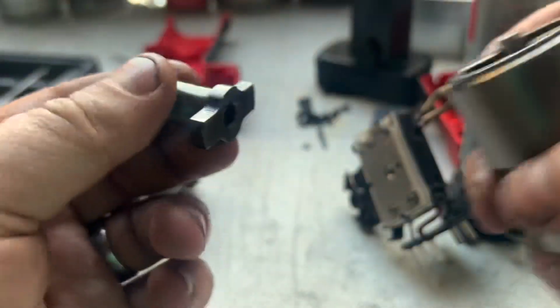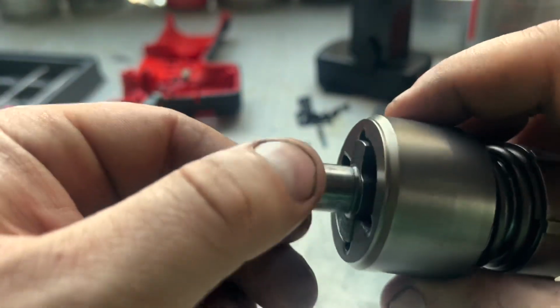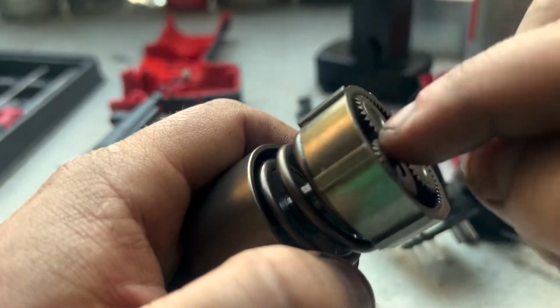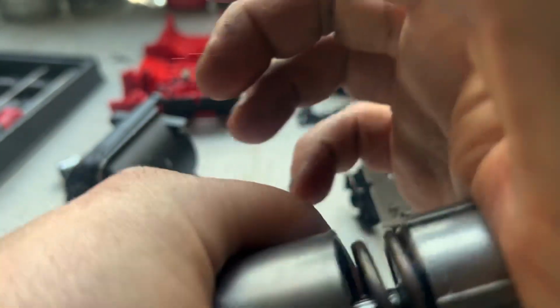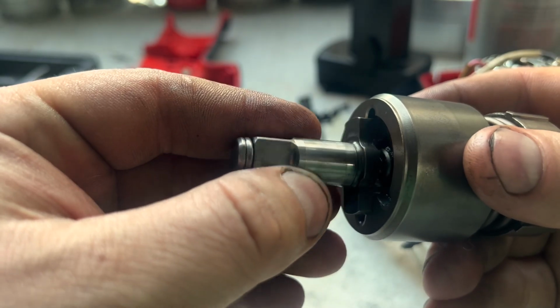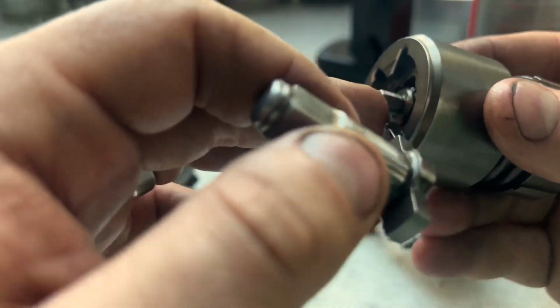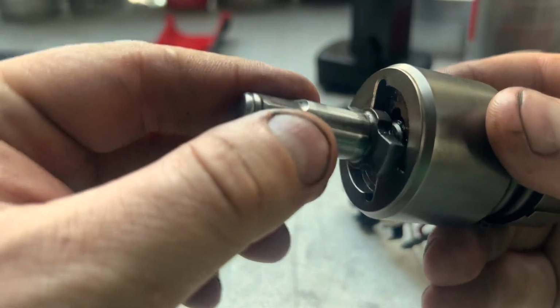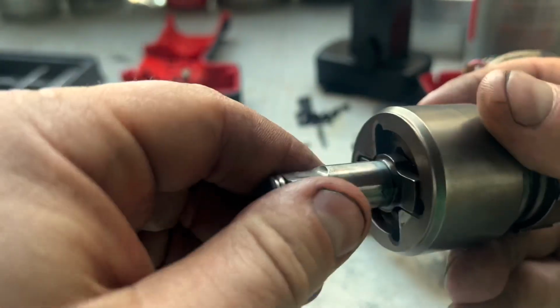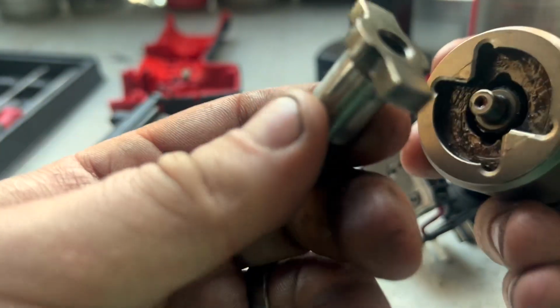There we go. So what happens is, as this is stopped, the torque from the gun will turn this and in turn close that spring. And then it's the force of that spring once it overcomes up here. Once the travel of this piston has gotten high enough that this can clear it, then it'll release and drop in, and there you go, whack, whack, whack.